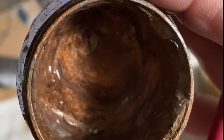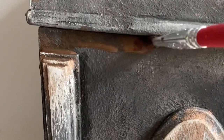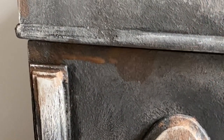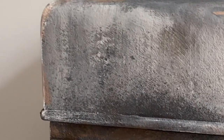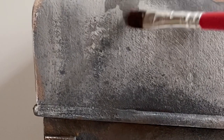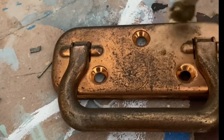Here's where I'm going to share a little secret with you — that mousse itself is dried out and hard. This is actually a really neat trick. I'm going to take that hard gemstone mousse, which is a water-based shiny metallic glimmer, and I'm going to wet it by applying it with a brush and then spraying with water. You're going to get almost like a shimmery effect on the front of your furniture, and since I'm mixing it with water it's a lot less of a shimmer consistency than using the gemstone mousse in its liquid base.